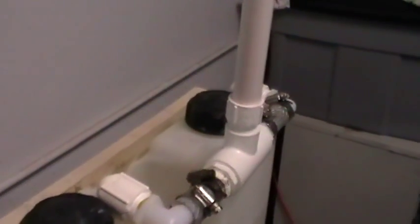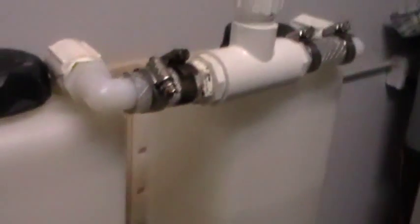Here's the top — you can see the caps and manifold. I built it with all three-quarter inch fittings, about an 8-inch riser tube to keep water from percolating out with the gas, and a three-quarter inch tube down into a makeshift bubbler I put together with what I had laying around the warehouse.